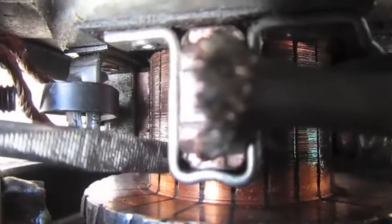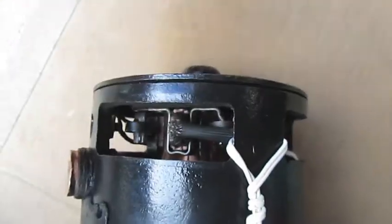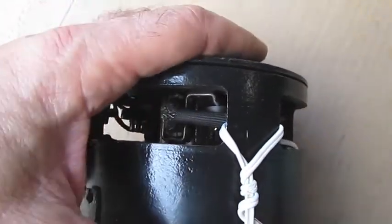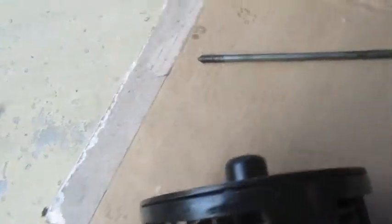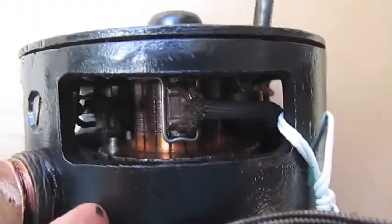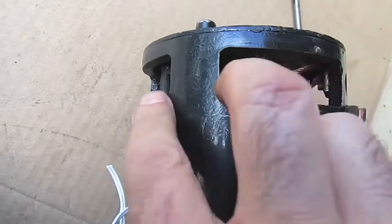For the fourth one — when you get all four shoes aligned over the commutator tip, you push down and they'll all just slide on. You'll be saying your blessings. But you're not quite done — you need to have the screw ready. While holding everything with one hand, take the screw and start threading it in. One thing I found: there's a screw hole here, but as soon as I push down, it was hitting my wire — but I kept one screw hole clear of wire so I could slide the screw in.